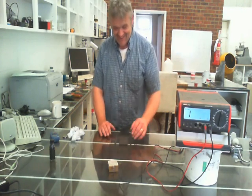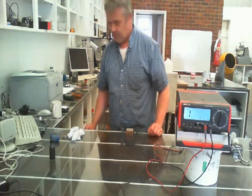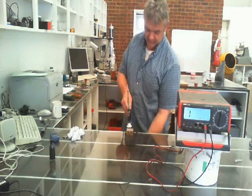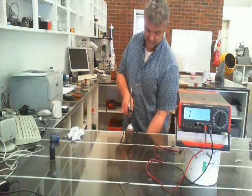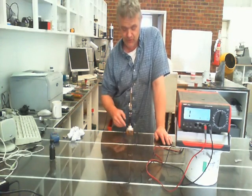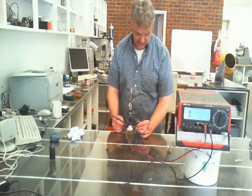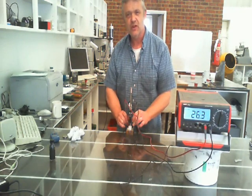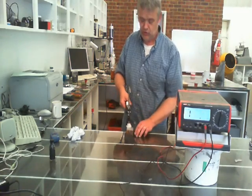Because it's so much more conductive, you can't actually measure it anymore with the cheaper ohm meter. So I've got the ohm meter set to an ohm reading here. This is a better quality meter, so it's more accurate and will register lower resistances than the other meter I was using. I've taken the square probe out from the other meter, and the reason I put the clamp on is to make sure that we get good contact across the surface of that ink. If I measure the square resistance of the unburnished ink — so this is ink that's just been applied by a brush — and I measure that resistance, you can see it's 26.2 ohms. So the square resistance of that film is 26.2 ohms.